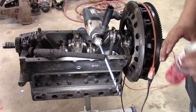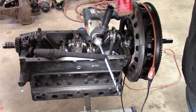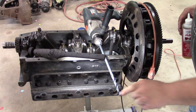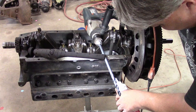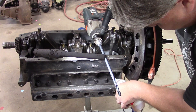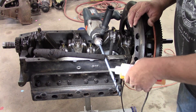I'm going to put a little cutting fluid — it's made by Tap Magic — and I'm going to lubricate the drill bit up here on the shank and down where I'm cutting. I'll put some up on the shank too.